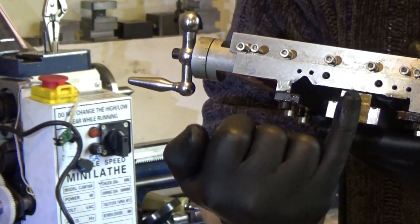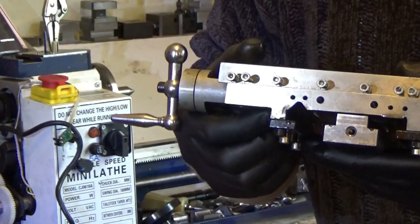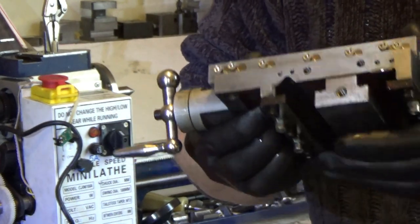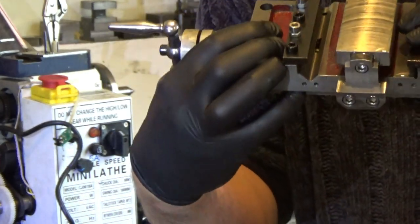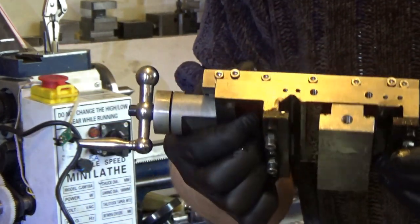The shank is going to go into the piston, which is going to go up and down, which is going to draw that gap up slightly. It's very hard to move, as you can imagine, because it's pretty thick steel. It's bolted onto pretty thick steel. There's no real flexure there, but there's about 1 thou of clearance.